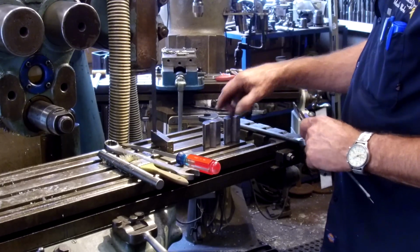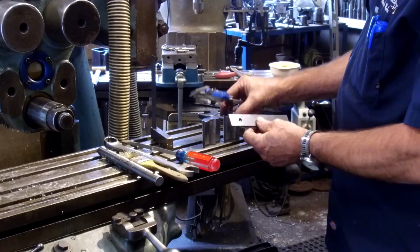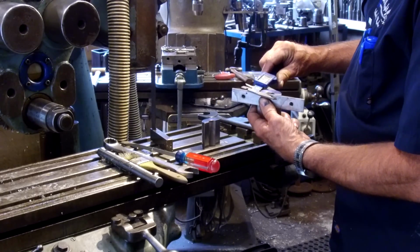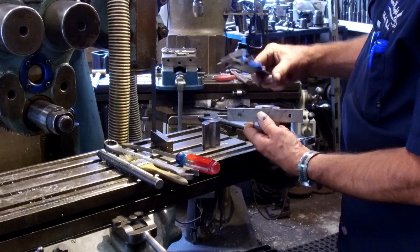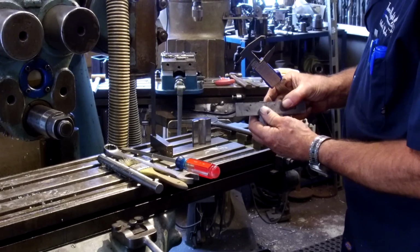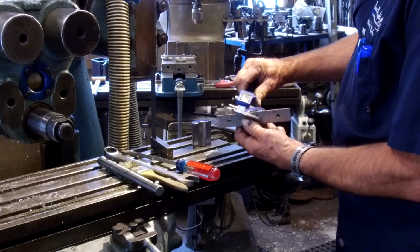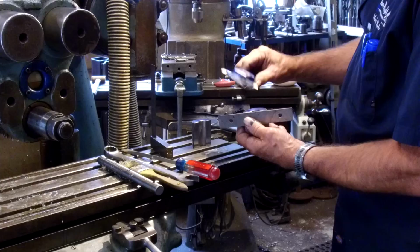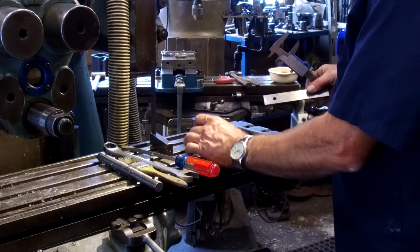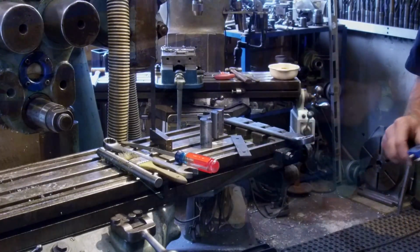Two spots, okay? Now, we got a 1/8 parallel, and that means we're just going to use this on both of them, okay? So, right there, we're just going to measure straight across the outside there. 1 inch, 49 thousandths on that one. And 1 inch, 38 thousandths. So we were 5 thousandths off center. All right. That's pretty fair by eye.